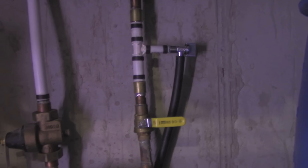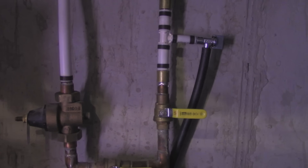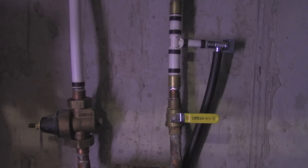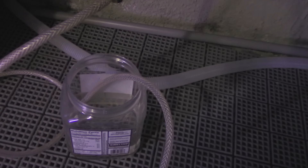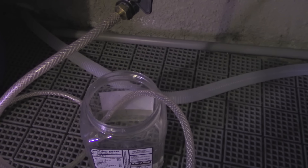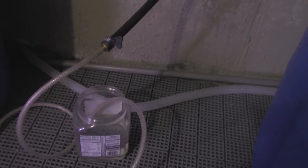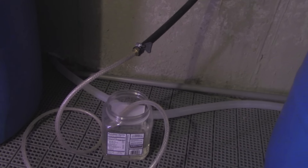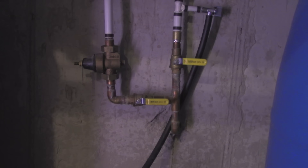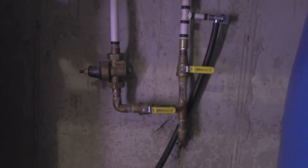So my one really good bit of advice: if you don't have a compressor, at least open up the lines — that will probably do if that's all you can do. And then keep them all open, make sure you have one of these drain valves to drain out what's left in your pipe, and leave it in some sort of container all winter long to catch the rest of the water that seeps through. I hope that's helped. I know it's been quite a messy video — it's hard to film with the compressor going. But if you have any questions, go ahead and ask, and either I or somebody in the comments can maybe give you an answer, because I know this is different — different layouts and different plumbing in different parts of the U.S. Thanks for watching.